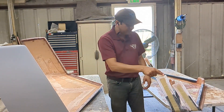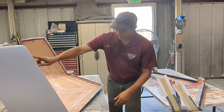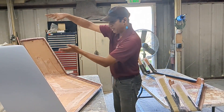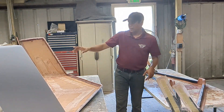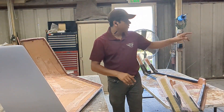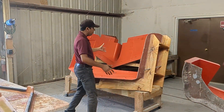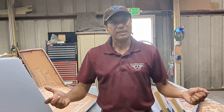That's what sticks everything together. We put more beads of it on this flange and on the backside. Then we take the top half and put it on there — so it's bottom, center rib, and top half together — and it goes in the mold. Here is the mold for the bottom; there's the mold for the top. The mold closes on it and compresses it. Then we let it sit overnight, and when it comes out, it's a very structural, light, and stiff part. That's how the tail is made.